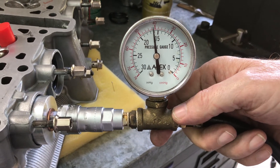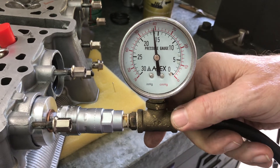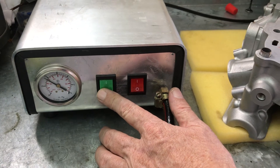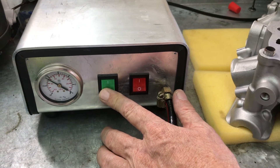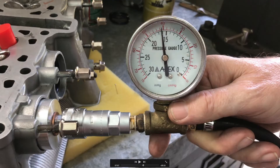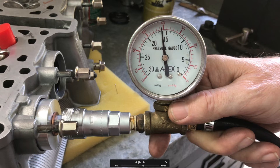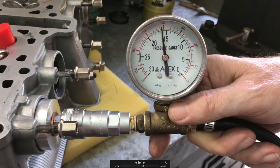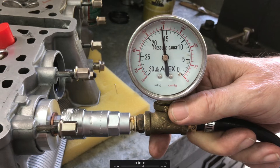Switch the green button, watch the gauge — ready, back to the gauge. Dropping like a stone. Here is the money shot: you can see that this cylinder is leaking. The sealed vacuum was 22.5 inches of mercury, and on this cylinder it is 16. The end — it's dead.